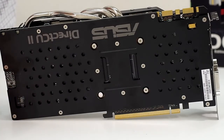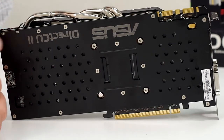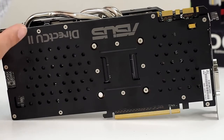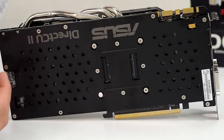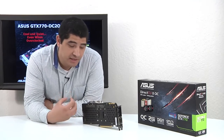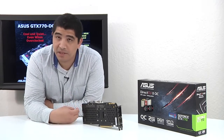If you take a look over here in this back corner of the card, we've got a couple of really nice additions. One is going to be direct voltage read points. For you guys that are overclocking and tuning the card, you really want to have that hardware layer of confidence at knowing specifically what voltages are running through the graphics card. You can go ahead and use your digital multimeter and you'll have that specific information. In addition to that, here on the top we have LEDs that let us know whether we actually have power actively connected and being provided to the card. If so, it'll light up green. And if there's an issue — a missing power connection or power is not directly flowing through — then they'll actually light up red. In terms of the standard connectivity, PCI Express x16, Gen 3 interface, which will pretty much work on all active chipsets. From there, we're going to go ahead and actually take this card apart and take a look at the heatsink and fan assembly as well as the full non-reference PCB and power componentry.